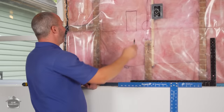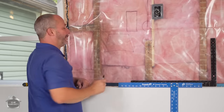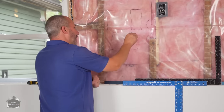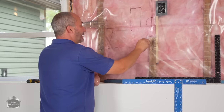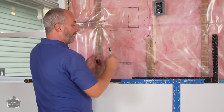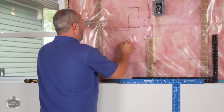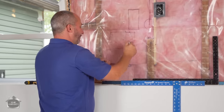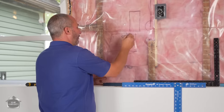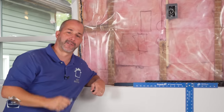But in reality, your room is probably more like this. And then when you put your drywall against the wall and you've measured from this point to this point and it says 11 feet, you cut your drywall square and what you get is this. You get a piece of drywall that goes like this. Now, if you turn that drywall to fit, now your drywall doesn't fit the hole. It's long on one side, big gap on the other side, causes your world to hurt.